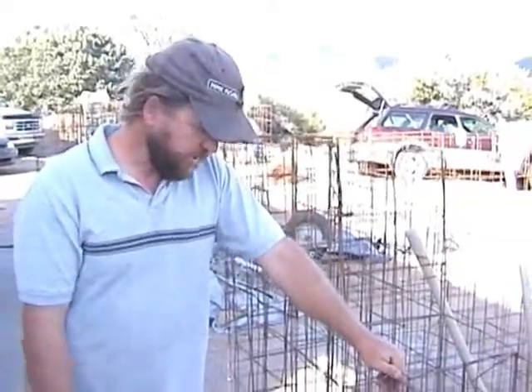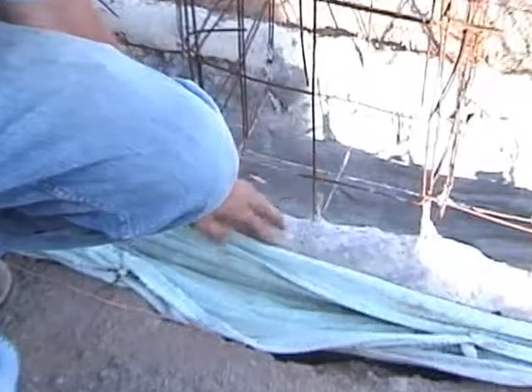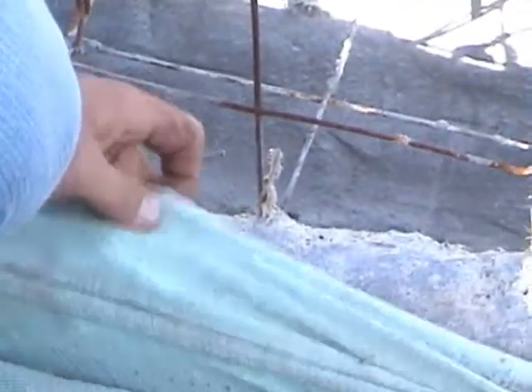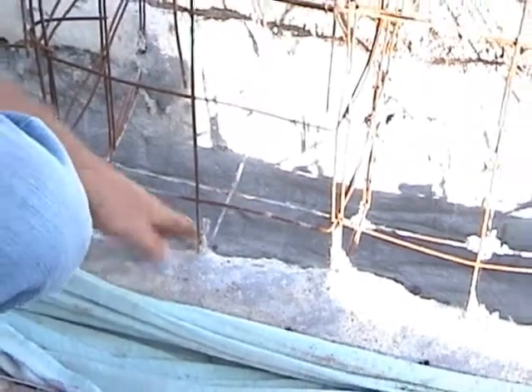We are back at the laminated ferro cement foundation, and we finished it up and moved on to the next stage, which is building the walls. Part of the detail I wanted to show: we did a transition detail from the foundation to the connecting edge. This is a little more than just connecting in the blocks. We took a lot of extra care to make sure this cures correctly — it's an important detail because it transfers the load of these surface shells over onto the plate below.